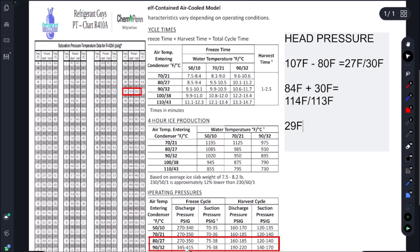Going further — at 90°F ambient, the chart gives us 415 PSI, which corresponds to about 119°F saturation. So 119°F minus 90°F ambient gives us 29°F split. The split is fairly consistent across ambient temperatures, which is interesting. Based on the chart we can determine what condenser split the manufacturer is targeting during the cycle. We had 29°F — right there. We're in the area we want to be. Our head pressure is good.